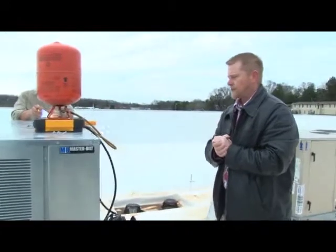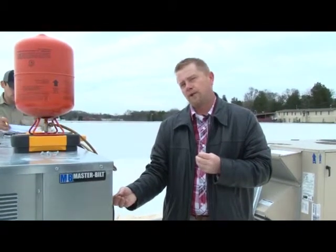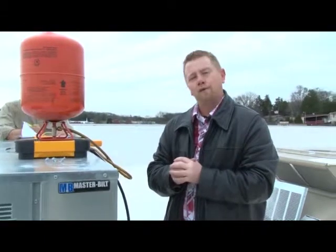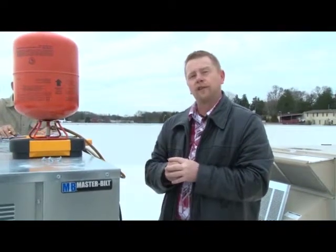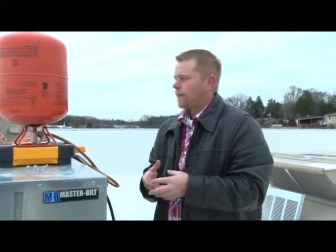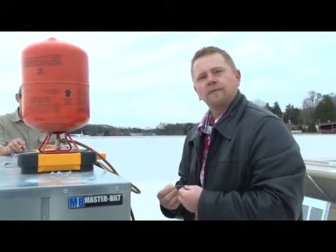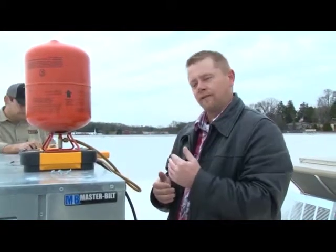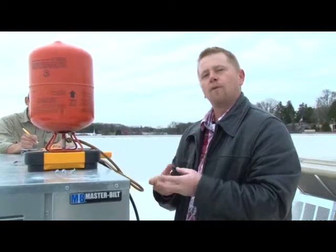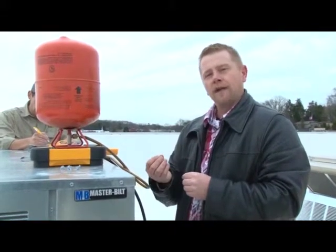Another key thing with these systems is it has a floating head pressure. There is no need to clear the sight glasses when charging these systems. A mechanical system such as this would probably take anywhere from 25 to 35 pounds of refrigerant to have a full charge, whereas this particular system would be fully charged anywhere from 7 to 9 pounds. You want to start your charge off very small — about a 5 pound initial charge. We will then cut the system on and let it run and start to pull temp, then calculate the superheat or view the superheat on the master controller. Once we start getting close, we will be adding refrigerant in half-pound to one-pound increments to dial the charge in to be at the most efficient level.